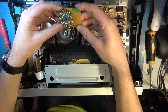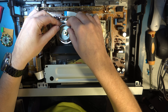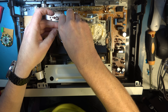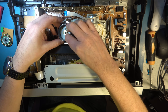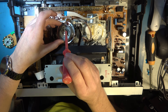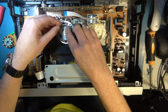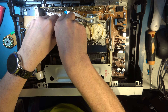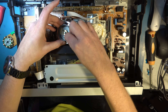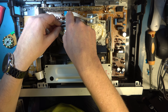The fault is not in here. The problem is that this magnet is supposed to be glued into position and it's not — it's free to move. It's slid around and massively altered the position of the head switching point. There's a small hole here which we believe is the marker for where the join in this magnet is supposed to be. There's what looks like a crack — that's where two halves of the magnet meet, and that's roughly where it's supposed to be, but it's broken loose. All we need to do is line it up with that hole and use a little glue to secure it in place.